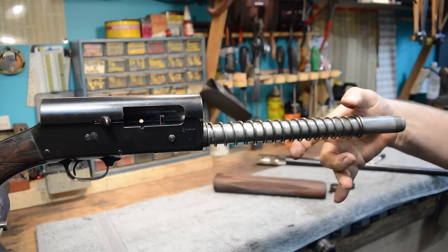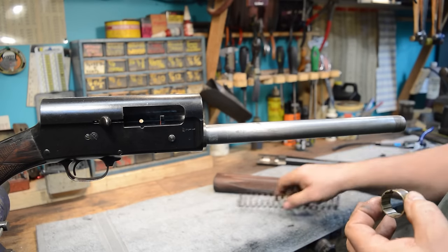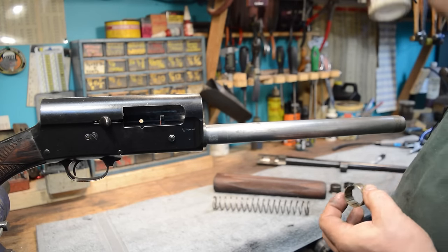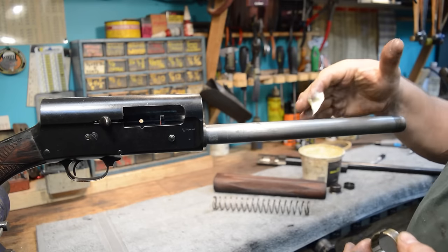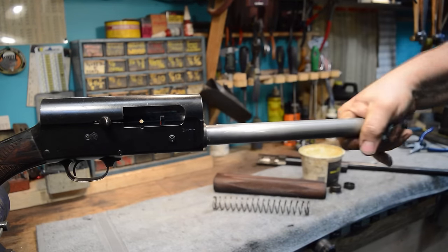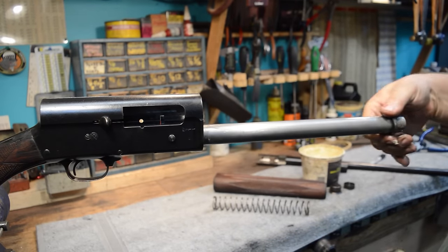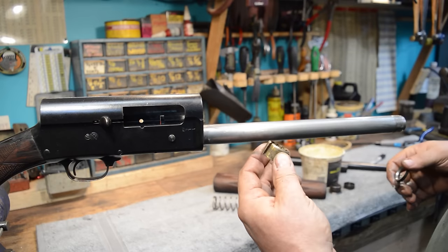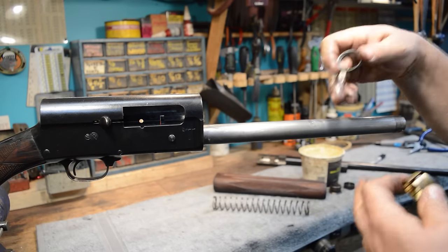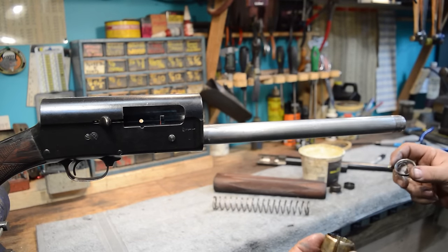The real trick is to remember that this entire tube is a brake — it needs to be lightly greased with a little bit of lithium grease, and I mean just lightly grease it at the beginning of the season so it's not galling the tube while it's sliding down it. That's what the grease is doing. Trust me, if you squeeze this down enough the grease will fail and it'll just slide brass on steel — you'll be fine.